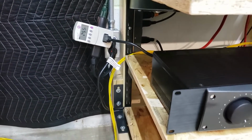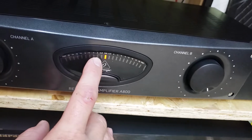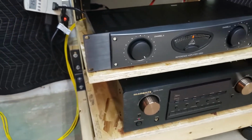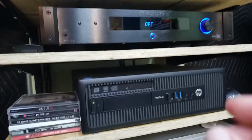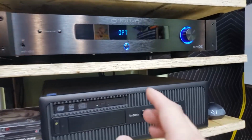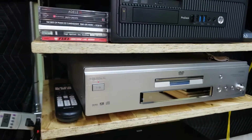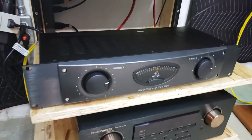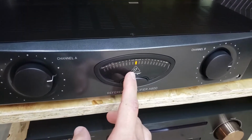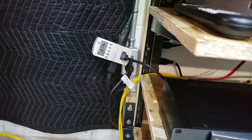But anyway, as you've seen on the meter here, we were getting really close to clipping. I mean, it wouldn't have taken much more and it would have started clipping. And I've tried to back these down a little bit and then push more out of the Emotiva, because the highest I had this during that demonstration was 50, and it goes to 80. I'm assuming at 80, that's when you're getting the 4 volt line out. But either way, to get that volume that I just had it at, the VU meters almost always end up around clipping. And it's usually right around, I'm going to be pretty wide, 40 to 60 watts.